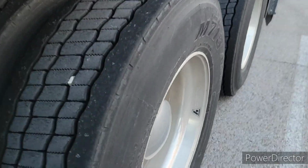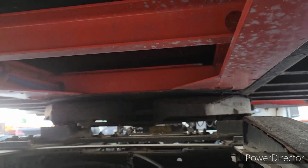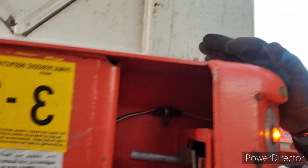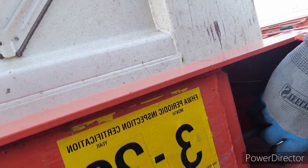Start on the driver's side, go down, around the back, come back up. And once again, go back under the trailer. You go under the trailer when you're going back up. Check it again, make sure. Okay? Things we've got to do, y'all. Same thing up here. Check them kingpins, check the latch, make sure it's in there.